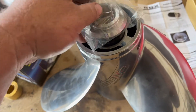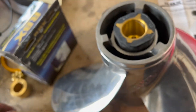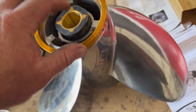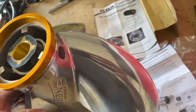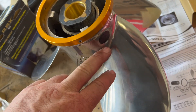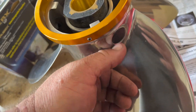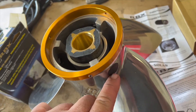We're going to put this on the press and press it down so it's nice and flush. It comes with a brand new stainless steel conical thrust washer, an extra adapter if necessary, a brand new nut, brand new washer, and a trim ring — the exhaust ring — which keeps the exhaust from slipping over the outside of the propeller. If we need to increase our hole shot, a 17-inch pitch is great for that, but the Yamaha propellers don't have any PVS holes — those are like slipping the clutch or having a stall converter in a car. If the boat can't get on plane or we're not getting enough wheel out of the hole, we'll pull these PVS holes out.